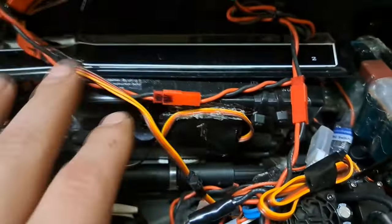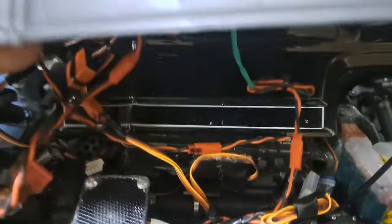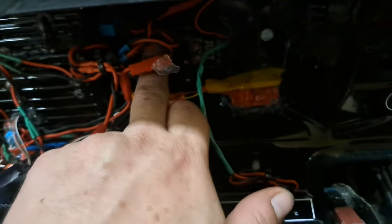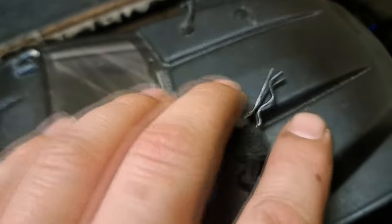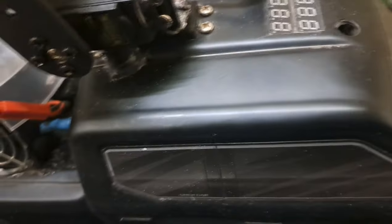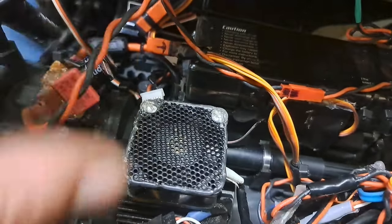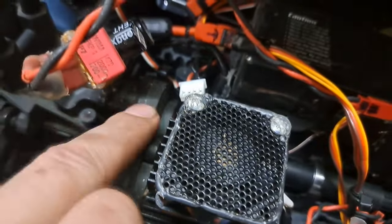The build also has capacitor feedthroughs, aux channel switch circuits for things like flashlights, an Arduino Nano sealed in a plastic bag with tape and glue, and two stacked 3S batteries — one for all the video electronics, one for the car drivetrain. The body is thick and sturdy on this truck, especially the top section. I zip-tie the clips for extra tension. There's still a little bit of wiggle when driving, which is why the Typhon looks smoother — I mounted that camera solid to the chassis.